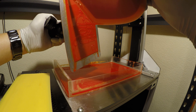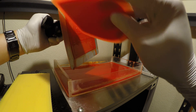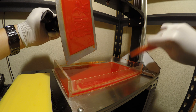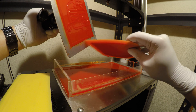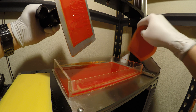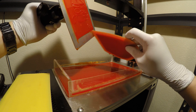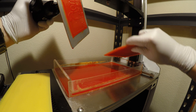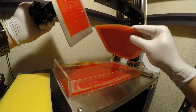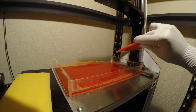The frame is thicker than the base layer but shorter than the lettering. There's a very thin film layer around the edge designed to be cut by a knife — we'll see if that works out. You also need to be a bit careful during the finishing process to make sure the object does not warp. I like to leave it on the build plate for as long as possible. Let me go and clean this thing off and then we can see how it looks.